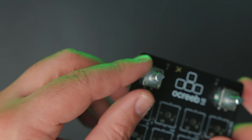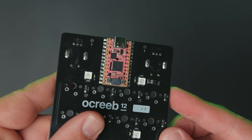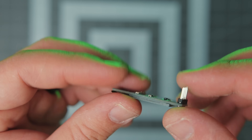The two encoders in the previous build required six pins. Given that we don't have a lot of GPIOs this time, we're going to have just one. But in exchange, we'll add the much-asked 0.4-inch OLED screen. I will be using one of these widely available I2C OLED modules to display layer changes and maybe other information.